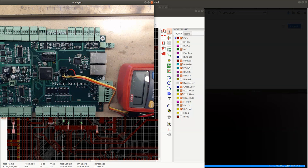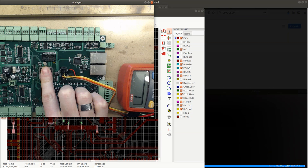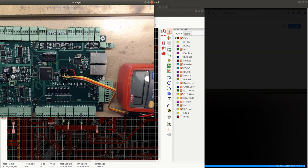So let's see what we get now. I'm gonna power it on, and I'm getting 0.02 amps. Fascinating. Is the chip broken, or is it something else? So, let's measure the voltage on different supply rails that go through the CPU. I have the reference voltage and I also have the main CPU voltage. So, it could be something like that.